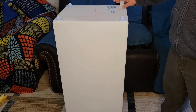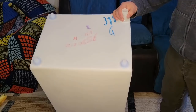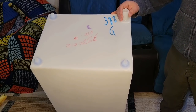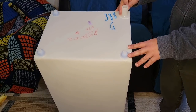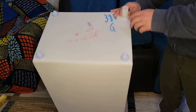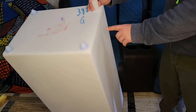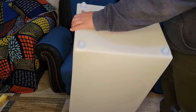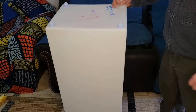Let's head over to Lowe's to pick up what I need. I need a hose with at least a one and a half inch inside diameter because the outlet is one and a half inch outside diameter. I also need to get something to drill the inlet hole and a plug to go in it - I have to make sure I drill it in the right place.